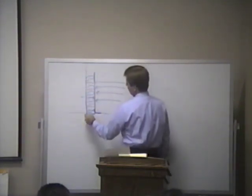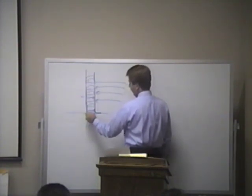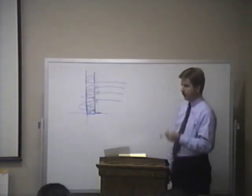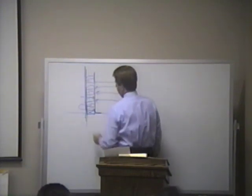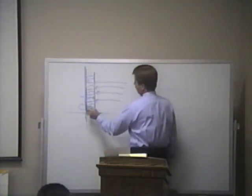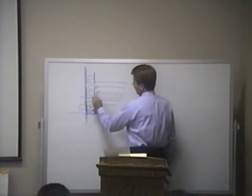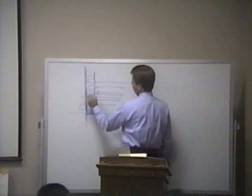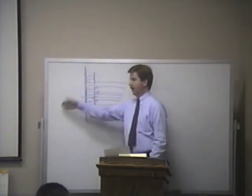If you leave it natural on the exterior, then it's available to breathe and work with nature and the swings of the temperatures. If you seal this at this point, then the swings, this will try to be more constant with this. And these odors, moistures, and items will end up in your wall over a long period of time if it's sealed at this point because it can't get out.